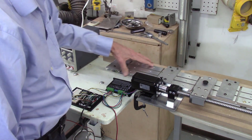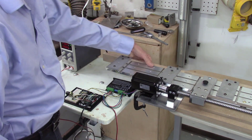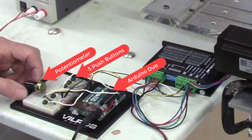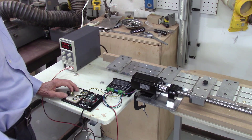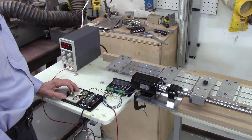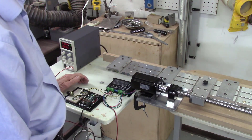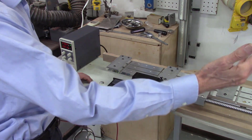With the six-foot rail I've been able to slice boards up to 50 inches long. I have a potentiometer to control the speed, and one study I'll be doing is cutting boards at different speed rates to compare the finish. With the automated system I can run much slower than doing it manually — you can let it take its time going through a board, and once I add automatic stops it will stop itself when done.